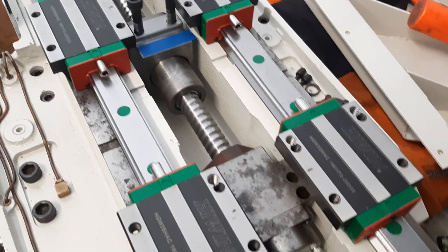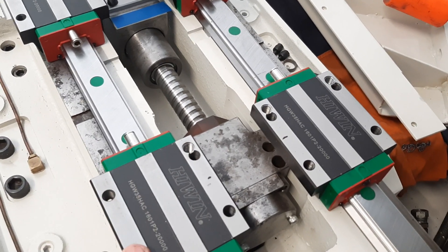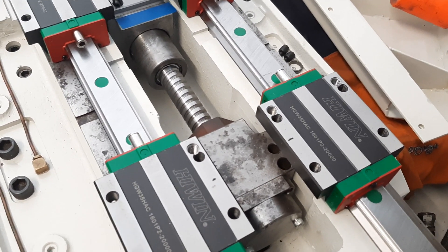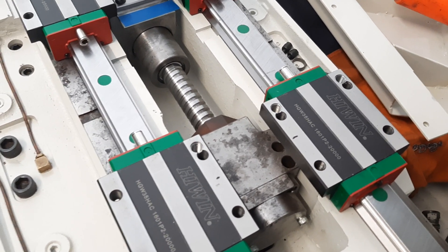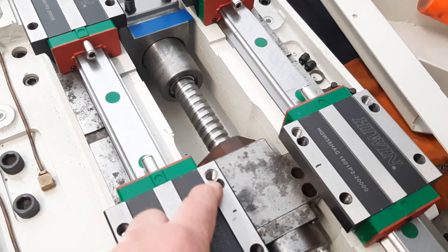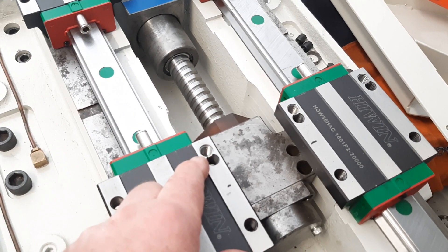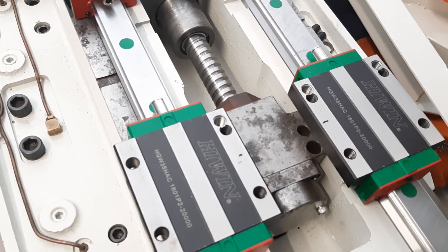The actual Hiwin linear blocks that I've already shown you in another video earlier - where I've swapped them over and I've had to re-drill the holes to match up with the NSK and modified as best as I can. I didn't want to modify the actual Mazak setup, so I modified the blocks instead of modifying the actual turret unit itself. They are case hardened and fairly high grade steel underneath too, so it was fun to drill and tap these. But now that it's done it's good.